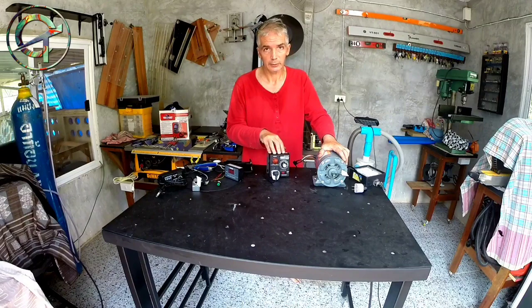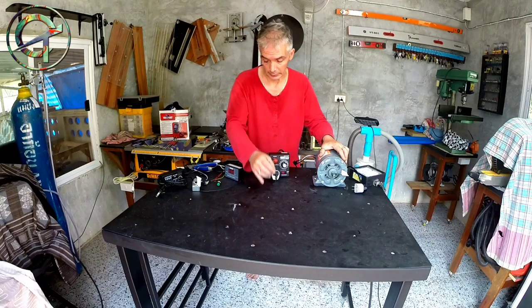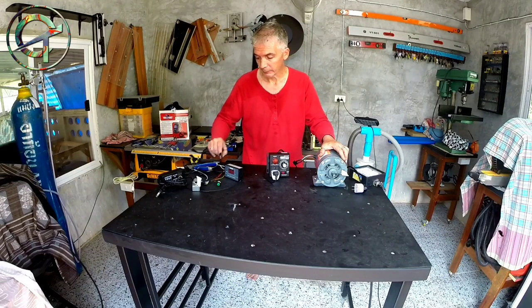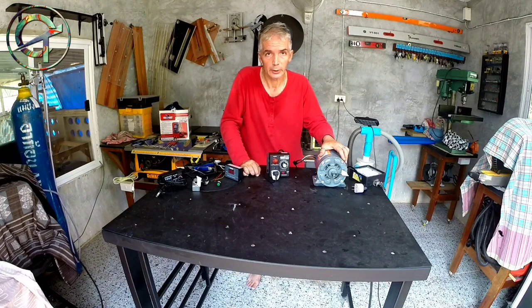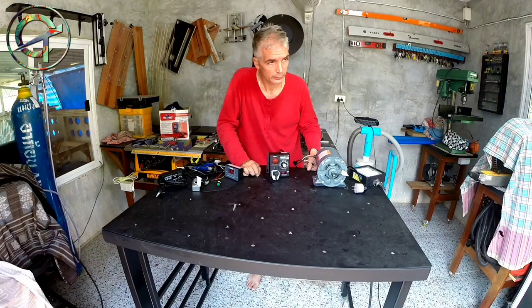Generally speaking, in this specific case, two forces are involved: speed and power, the motor torque. Through the speed controller, the motor speed is reduced. And unfortunately, also the power, the motor torque, decreases too. Once the current is less and less, the power, the motor torque, reduces too, until the magnetic field inside the motor coil is not enough and the motor stops. And I just showed you a motor without a load. Once the table is connected and a piece is loaded, the effect is even more noticeable.